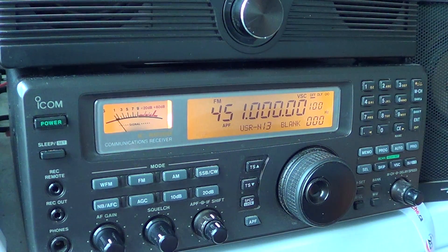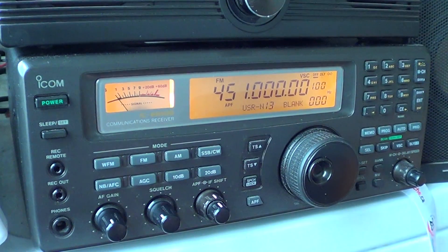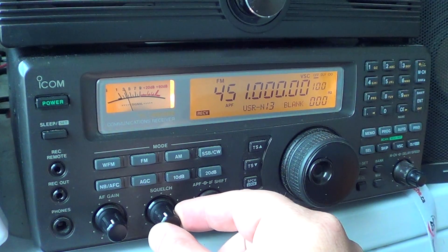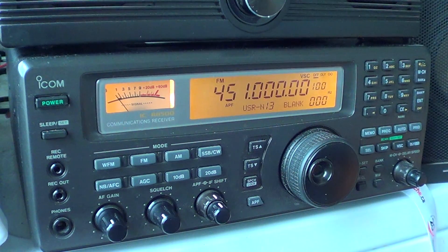You don't want to set the squelch too high. You might still hear a little short hiss. What you can do to reduce that hiss is raise the squelch a little more, but not too much — you don't want to miss signals. The ICOM ICR 8500 has a squelch trail that's a little long, so it takes a little time before the squelch kicks in. That's why you hear that brief hiss before the squelch actually works.